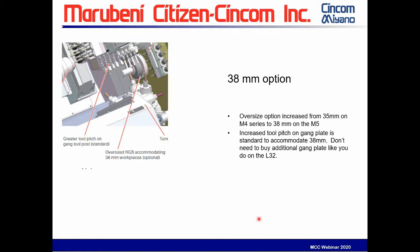The machine now comes with a 38 millimeter option, which means you can increase the capacity of the machine from 32 to 38 millimeters by changing out the guide bushing and the spindle sleeves. Something else that's significant is that the pitch on the gang tools here is now great enough to accommodate that 38 millimeter, so you don't have to buy a separate block if you do this 38 millimeter option.